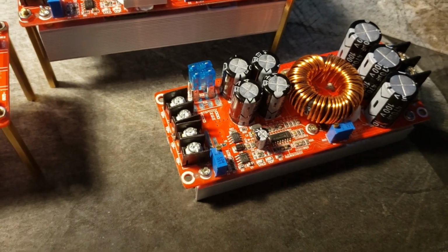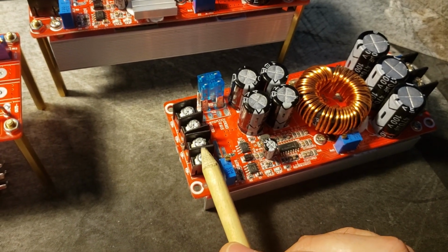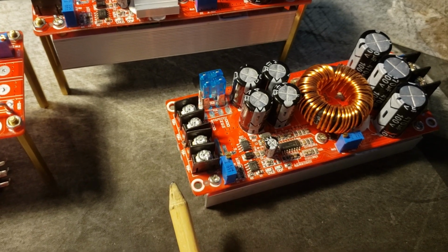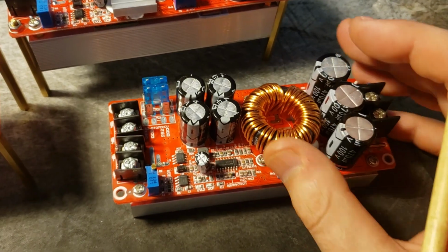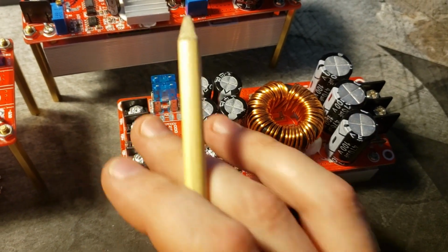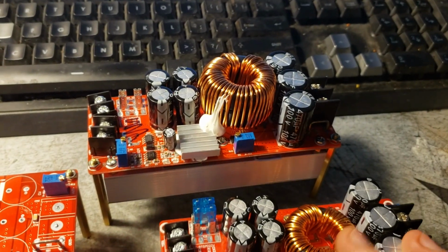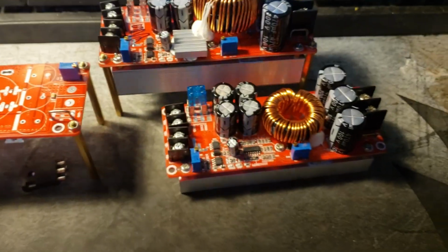I'm just planning for the worst, in case my voltage were to sag down to the 9 volt range, 8 volt range. I want these devices to function. It's okay if they get a little bit warmer, because that's not going to be a continuous thing. I'm not going to sit there and run this thing at 9 volts. If it just so happens to dip for a little bit, I want these to survive, and I don't even want to know anything went wrong. You know what I mean? So doing that modification allows you to do that.